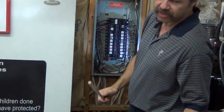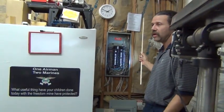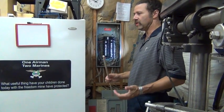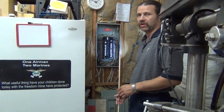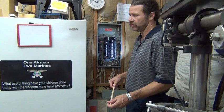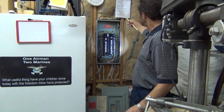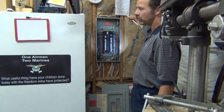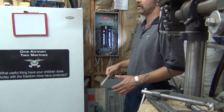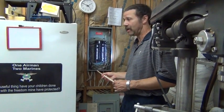Let me make clear that this is a live panel — there's power coming in and lights are on in the house. Some safety concerns: if you don't know what you're doing, if you've never wired before, this is not a project to begin on. If you're unsure of your own abilities, if you're concerned or worried, pay the money and have a professional come in, or contact the county. For this project, I've contacted the county, I have approval, and I know what I'm doing. This is one of the better places to get county government agencies involved because they're going to come back and be responsible for safety — they'll check it out and make sure the wiring is up to snuff.